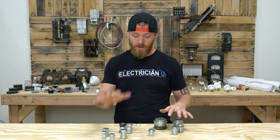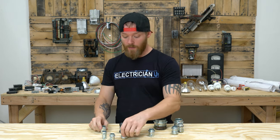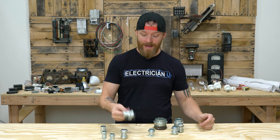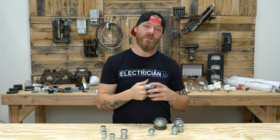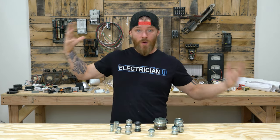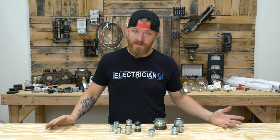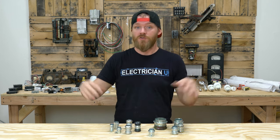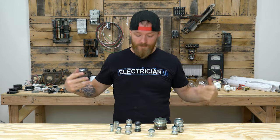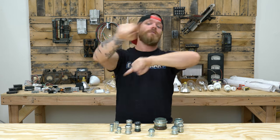But that's really the difference. You're always going to want to know if you're working with a coupling or a connector, whether you're set screw or compression, and whether you're indoor or outdoor. And if you're outdoor, you have to have something that is listed as a rain tight fitting approved to be used in wet environments. So let me know if you got any other questions. There are tons of different fittings and couplings and little variations on stuff, but if you want to see me go off in a different direction or cover some other materials, please leave some comments below and hit the little notification bell so you'll be notified of every new episode when they come out. I love you crazy people — I will see you in the next episode.